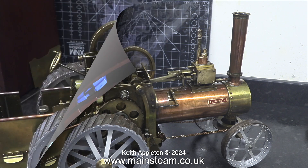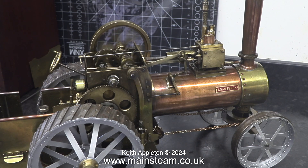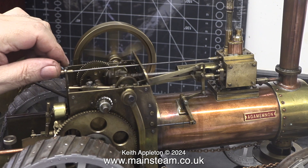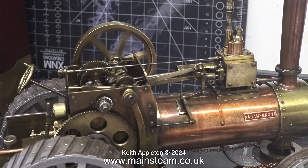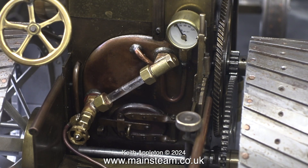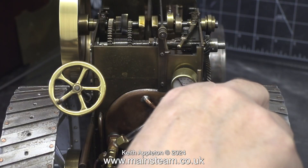I'm going to test the water pump. I closed the water bypass valve and opened the regulator, but at high speed I could hear the balls rattling in the check valves. A simple solution for that: slow down the engine. Here I'm experimenting with the bypass valve, which controls the amount of water that either goes to the boiler or returns to the tank. This is early on in the steam test and I didn't want to flatten the pressure too much. After a very short while the engine was still running and the water was going up the glass - I'm quite amazed by this. I thought it would have stopped the engine, but no, it's working very well.